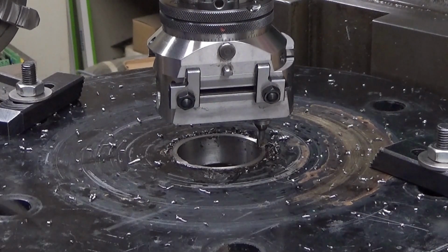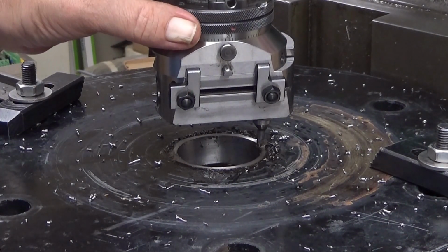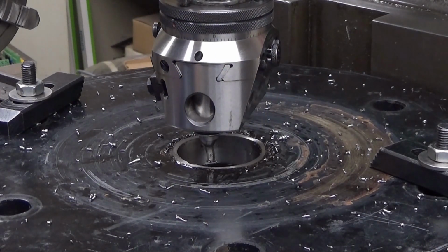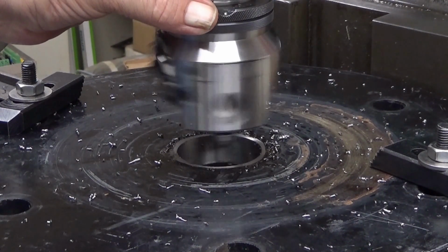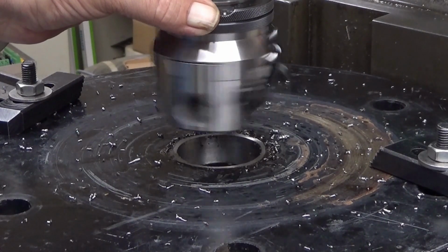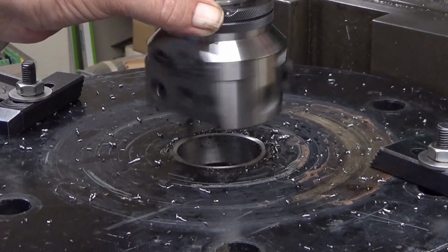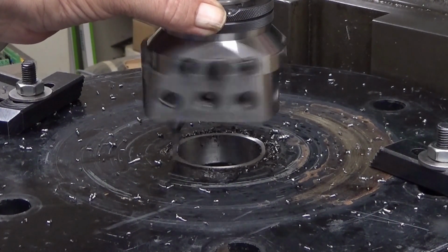So I will disconnect the drive here, like this. This knob comes up, and when I keep these both, it will retract the cutting plate, the boring bar. And now 0.25 millimeters more, and then I will connect this feed here, and now we go. I will repeat this until we peel off the paint from the surroundings. Well, it should start any moment now. Oh yeah, now.